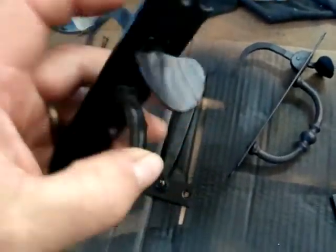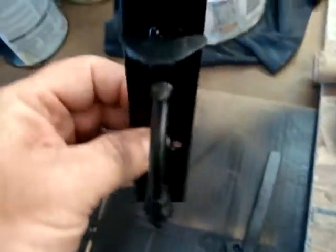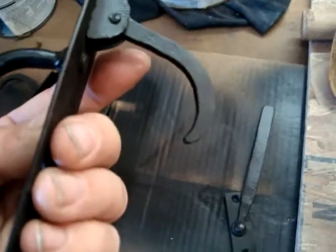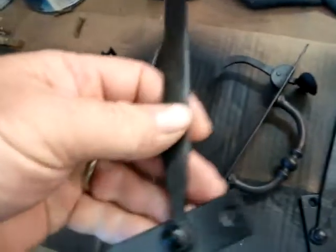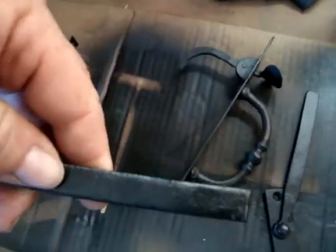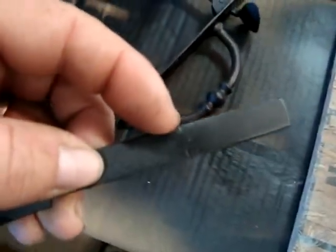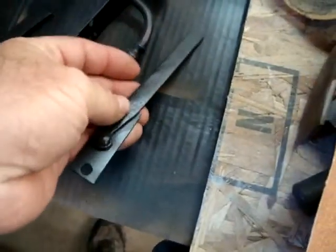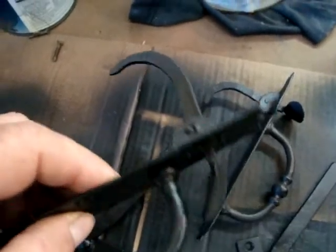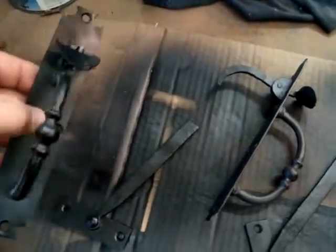Here are the laundry room door latches. I put the new thumb hole in this one. I had to fabricate parts on these. This striker latch goes in the back — this one was missing about this much of it — so I had to lengthen that back out. When you can't find these antique pieces and parts, you have to make them.